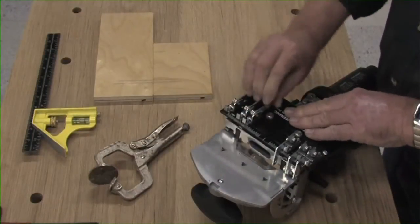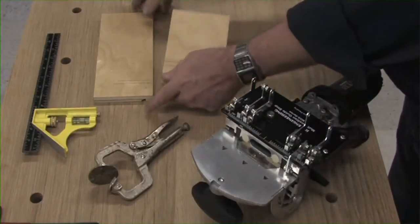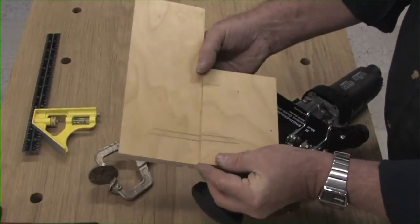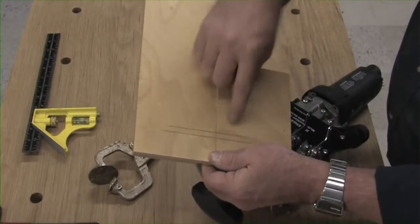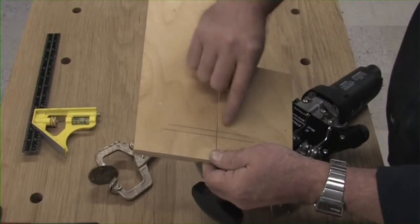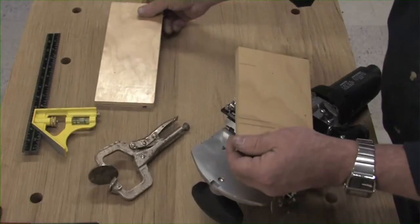To adjust the position of our stop arms, take 2 blocks of wood, hold them flush at one end, and then scribe 2 pencil lines across both blocks. This one is at 1¼ inches, this is at 1½ inches. We use 1 block for the right stop arms,